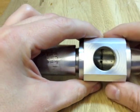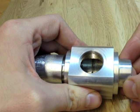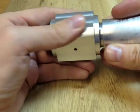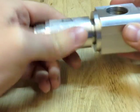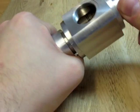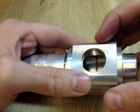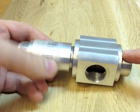I need to access the interior of this block. However, I couldn't crack the Loctite seal, and it's proved to be a real problem for me. The finish on this was beautiful. I've tried to protect it. I've had it in the vise, I've tried heat, I've tried force, and it's just completely seized up. In trying to remove this, I added this mandrel as a kind of handle to give me more leverage in removing this objective lens holder, and then heated it. But in doing that, I seem to have somehow welded these two pieces together. So I now have to remove both of them.